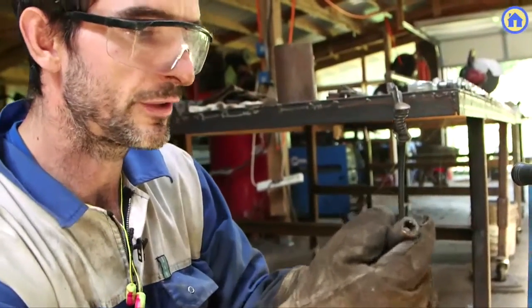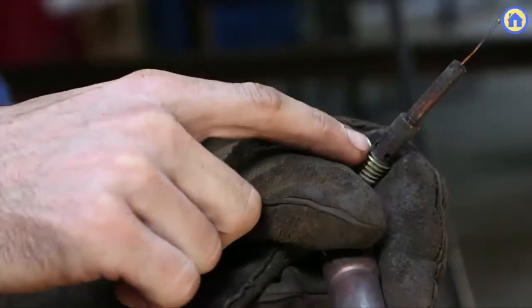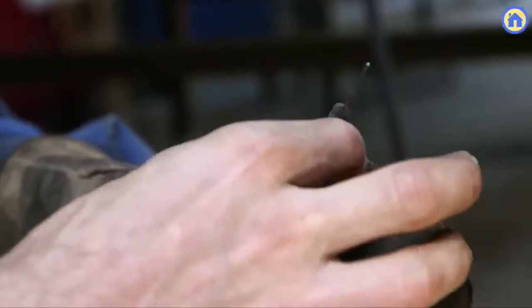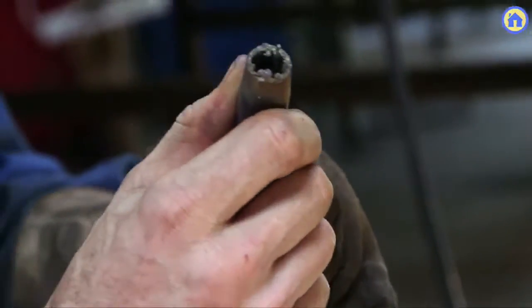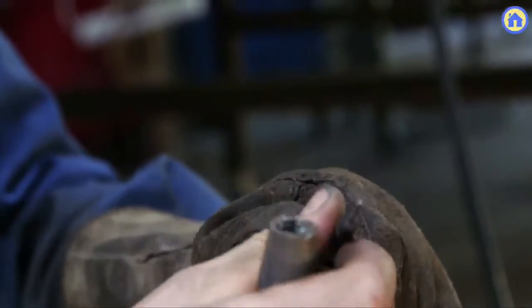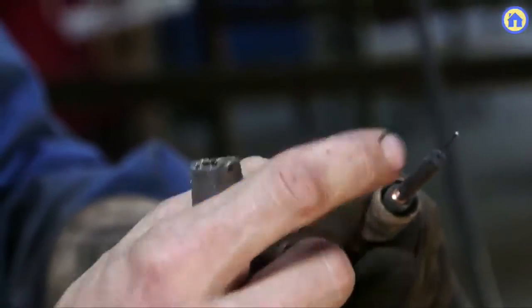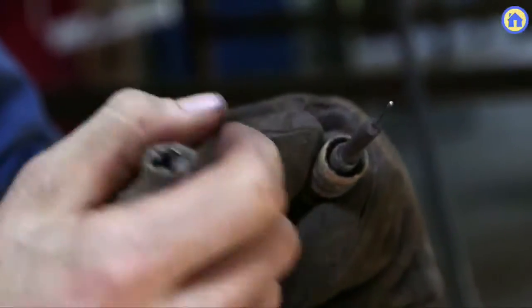A couple of things about the nozzle itself. Here's the shielding gas nozzle. There's a gas diffuser that shoots the gas into the nozzle — this is where the shielding gas comes out. There's also an insulator piece that you screw on, and then the nozzle. You can position the nozzle up and down as you like, but you want to keep the welding tip — which also unscrews and is replaceable — slightly recessed. The wire goes through the tip, and the electrical contact between the wire and the whole electrical system happens right there at the tip, so the heat starts happening as the wire is pushed out.